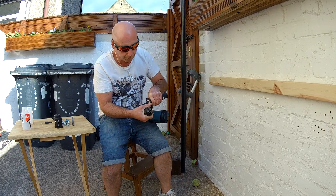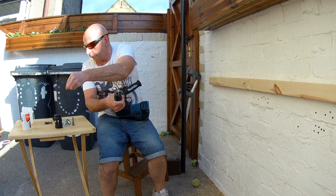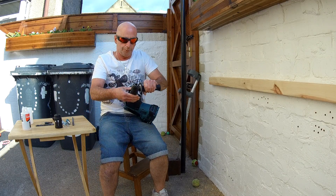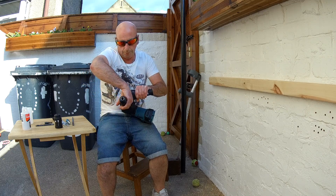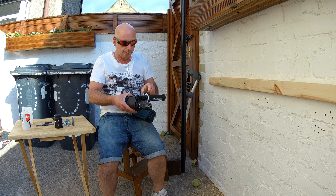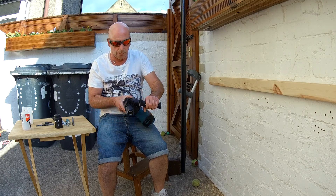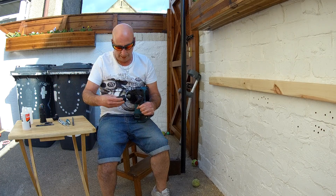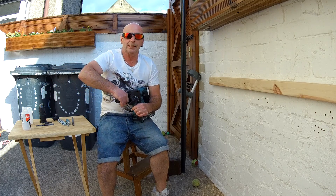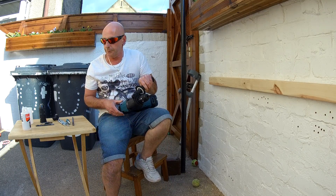Right, we'll take that away now and go back to the SDS chuck. I forgot — it does actually work better when it's in rotary hammer drill mode. It grips and clips off. If it's on drill mode it doesn't like to turn very well — that seemed to be my problem upstairs.